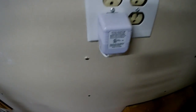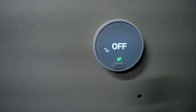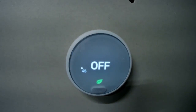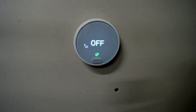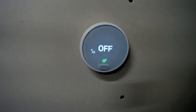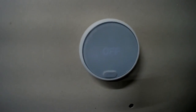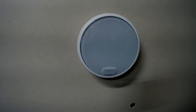You'll see this 24-volt AC adapter providing C-wire power up to the Nest so it can recharge itself. It was not getting enough voltage off the actual heater with 18-gauge wire, so I had to install the transformer so it connects to Wi-Fi and works reliably. One great thing about the Nest E is I have it set so the heater is normally off, but with a 35-degree emergency heat minimum — so paint and anything I don't want to freeze is protected automatically. We're on the west side of the Cascades, so we see 30s and 40s here.